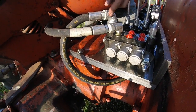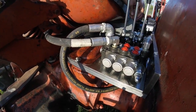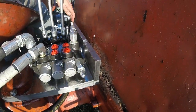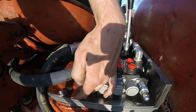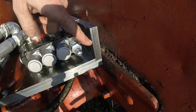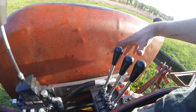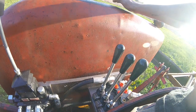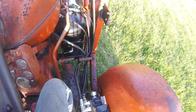As for mounting of the controls — excuse the mess, the oil got everywhere while I was building the system — I made this plate with this bar that runs up to the joystick and mounts the auxiliary valves, and that just bolts up sandwiched between the casing and the brake cover. There are also two bolts that run through the fender here. This is where the toolbox usually is, so I'm just moving that to my left-hand side. The toolbox that was on here was so rusted out, I'm just waiting for a new replacement to come.